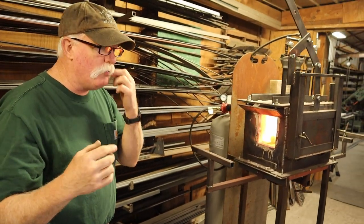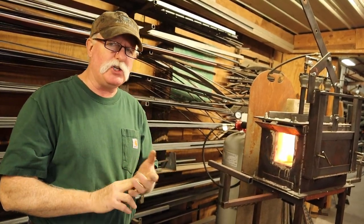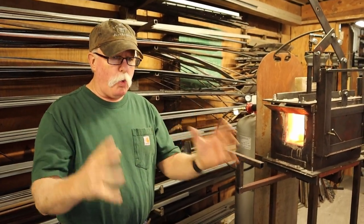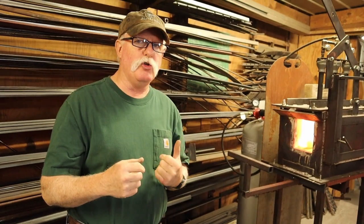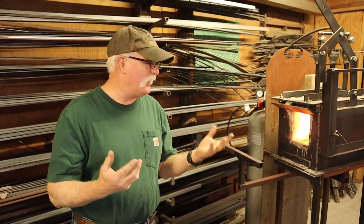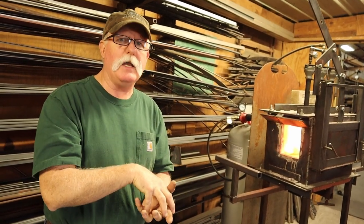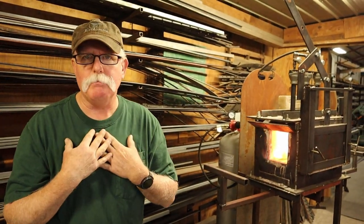I'm making this today, and for those of you who maybe haven't been blacksmithing in a long time and want to try your hand at making a real simple hatchet — you see this all over the internet — just get yourself a ball-peen hammer. There are a couple of things you need to know. You can find quantities of old hammers on eBay. Generally if they're pretty old, they are probably a forged hammer. You don't want to do this with a cast ball-peen; you definitely want to use a drop-forged piece of steel. This is a cheap Chinese-made hammer I picked up at Ace Hardware, but it said on there that it was drop-forged, meaning it has a billet that is hammered while hot. Some ball-peens are cast — they just won't work.